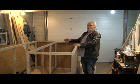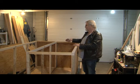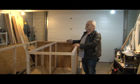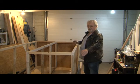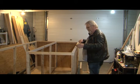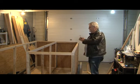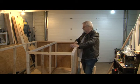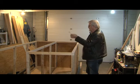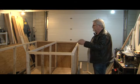So then we have a back wall here. The back wall is 70 and a half inches long, 37 inches high. We run supports every 2 feet, framing it in. So it's 24 inches on center up to here, same here. Now what we have to do is run some framing across here. We'll run it in the same spot. We'll run one here and one here, so we need 2 sticks to run there.